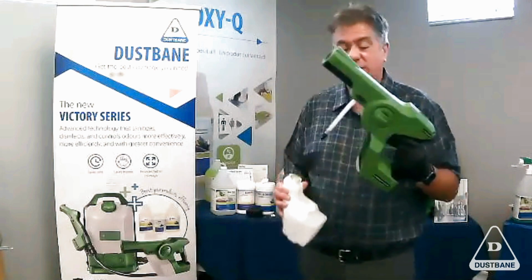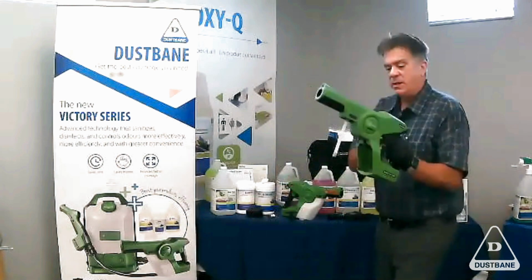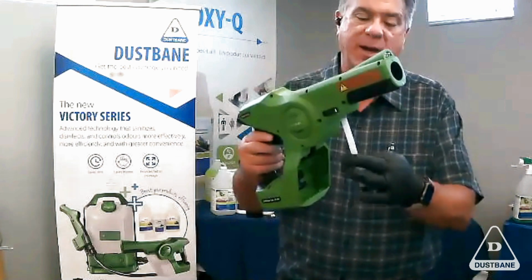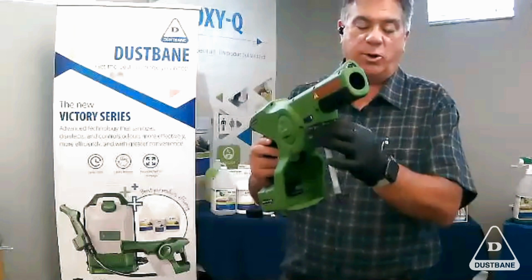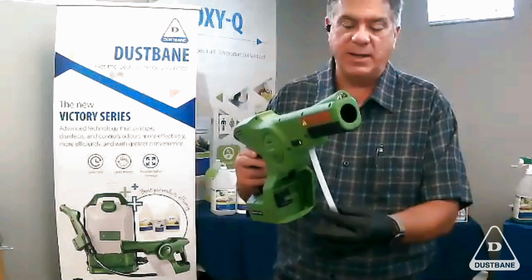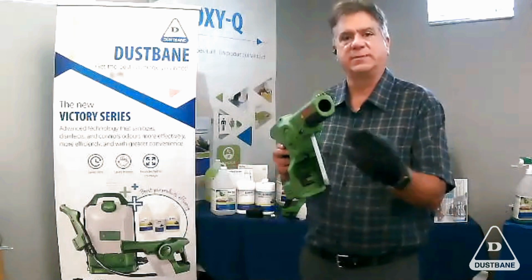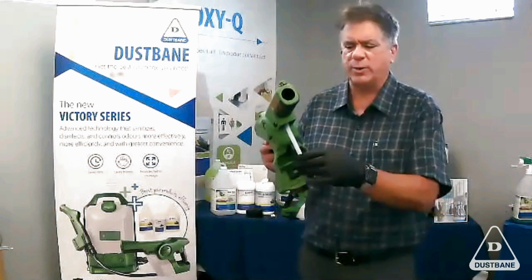And it's really simple. So I'm going to bring your attention to the straw, right? That's the straw where the chemicals are coming in. There's a filter there. It's important to notice that this always needs to be clean. It needs to be wiped. If you're in hard water, it may start getting some residue built up in the filter. No different than a proportioner, really.